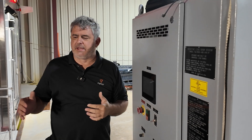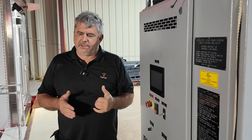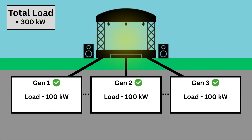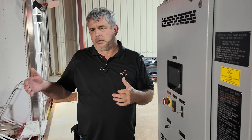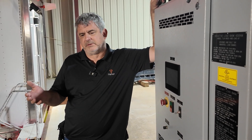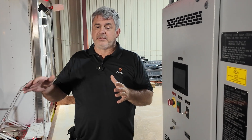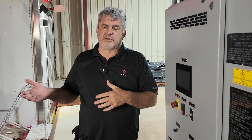People ask, is this a bad design? It's not really a bad design, because if you want N+1 redundancy — meaning if you had a design load of say 300kW and you put three generators on it, then each one's only doing about 100kW. So you're kind of forcing yourself to run these larger generators at a third or a quarter of their load if you're doing N+1 redundancy to make sure you don't have any problems. These particular generators are utilized in national broadcast situations so that the power can't go off. One of the penalties is that if you have a generator paralleled together that can back up another, it has to be large enough to take the load if one of them drops away. That creates the wet stack situation, because you're running a much larger-than-needed generator against a smaller load for redundancy. But that's what's required.